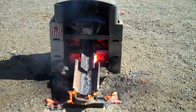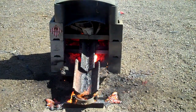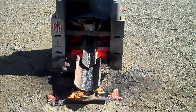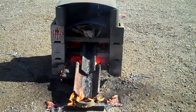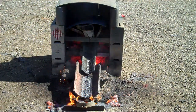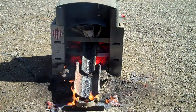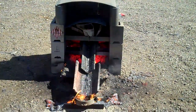Over 4,000 degrees Fahrenheit. The thermite is basically Fe2O3, and you have aluminum powder. The oxygen jumps off the iron oxide and makes aluminum oxide. It's a transfer of oxygen, which is extremely exothermic and energetic. And then you get liquid metal.